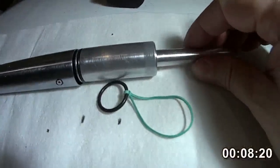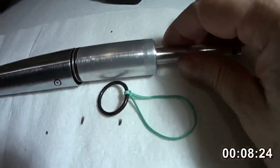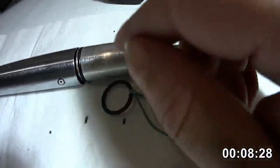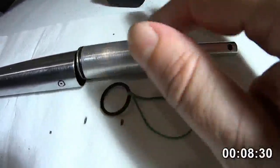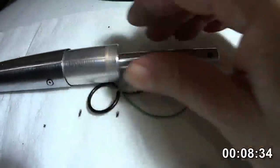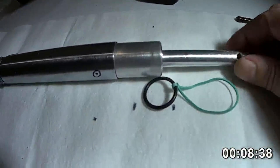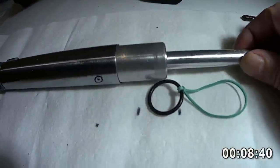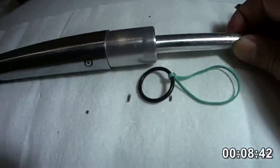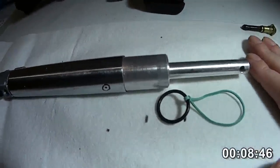So on hot summer days, you might be using this gun and you might find that it's going dry. What you want to do is wipe the cylinder while it's on the gun and then just apply maybe a nice little drop of lithium grease and start over and give it the grease it needs to function properly. So that's one of the errors that we make if the manufacturer has done their part, is we're not following the procedure of proper lubrication and care of the weapon here.